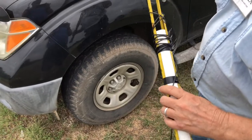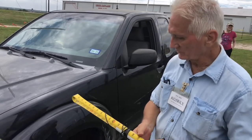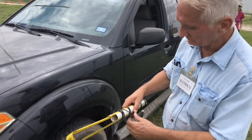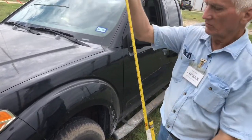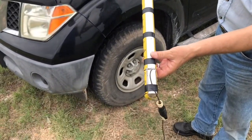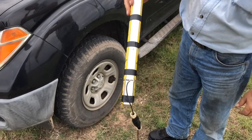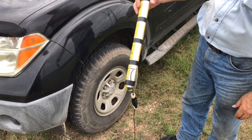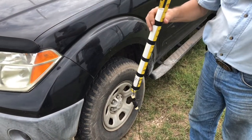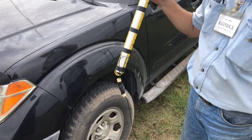I used a full length of PVC on that part and decided to try it a little bit lighter weight. If it's not windy and it hangs up, it attaches right there. You have to find where your 50-ohm point is — this end being zero ohms and the other several thousand ohms. It just happened to be right there. On the other one it's a little bit lower. It varies for some reason — maybe the thickness or width of the tape. I tried this with a choke and it didn't seem to make any difference, so I left it off.